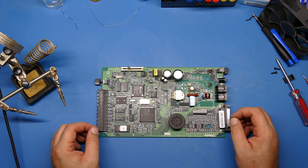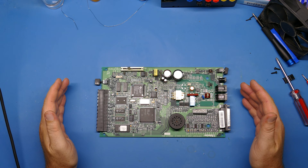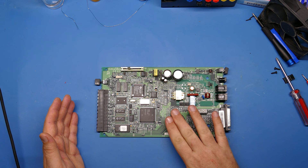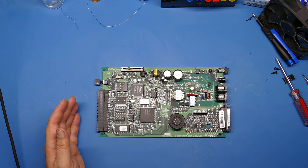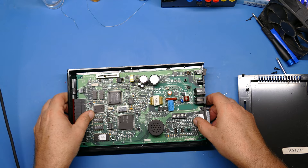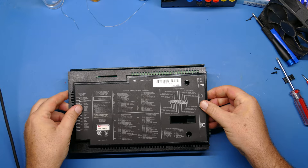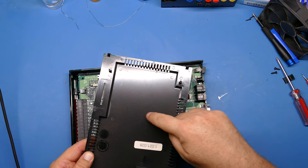There are a couple of things driving my decision on which microcontroller to use. I could use a multiplexer chip, but I don't want to mess up the board — I want to be able to reverse what I do. There's plenty of room inside the case. I think the top is kind of shallow, but there's a good inch in the bottom where I can easily fit a flat microcontroller and tape it there. If I want to drive all of these LEDs without a multiplexer, I'm going to need a microcontroller with at least 12 to 13 free GPIO pins.